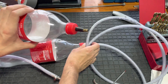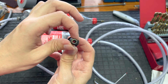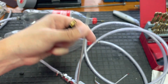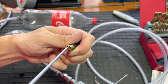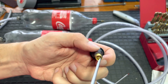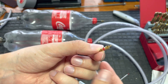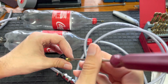You'll need those for the ends of your connections going into the bottles, and one of them you'll need a valve core in. The valve cores can be removed for the rest. To remove the valve cores, all you need is a small screwdriver — just insert it down the side and give it a little turn, then unscrew it. You only need one valve core because all the rest can be open. If you don't open the valve cores it won't work properly, because you'll trap the air inside the system.